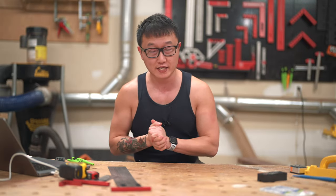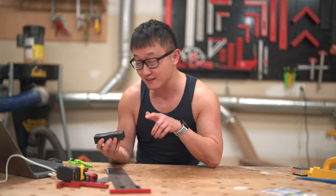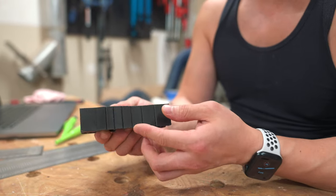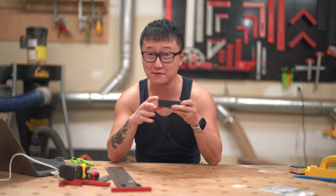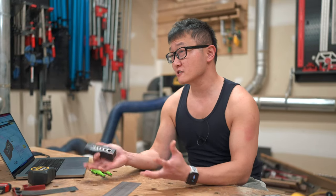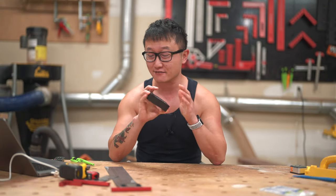When I first started woodworking I didn't have a drill press, so I got this drill block from Miles Craft to help me drill perfectly perpendicular holes. This thing only costs $8, and for that we get six steel bushings for commonly used drill bit sizes and molded-in guidelines on the sides to help with lining things up. Even though I now have a drill press and other drilling jigs, I still use this all the time — sometimes workpieces are too large for the drill press, sometimes it's impossible to use large jigs, like when I drilled holes under my desk to mount electronics holders, and sometimes I just don't want to spend time setting up just to drill a couple of holes. For $8, it's a fantastic investment.